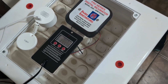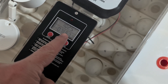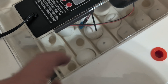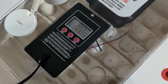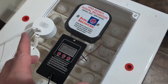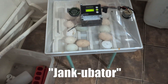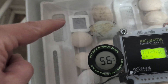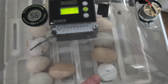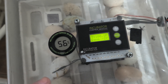I'll get to some of the software stuff, but basically I never trusted the humidity and temperature on the built-in sensor because it looks like a DHT11, and those are pretty inaccurate. So I've thrown in several different sensors because you never can trust just one. I've done the same thing on the Jancubator, as I call it — there's one of the little ATC ones in there, and a Zigbee one, because this one isn't all accurate either.